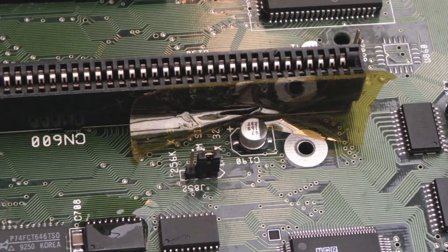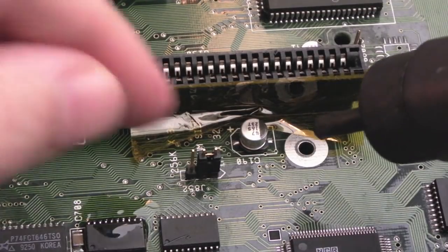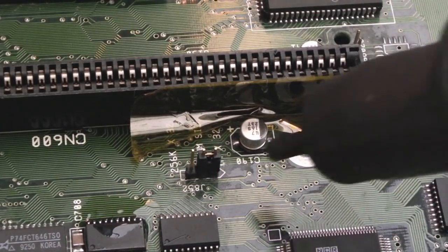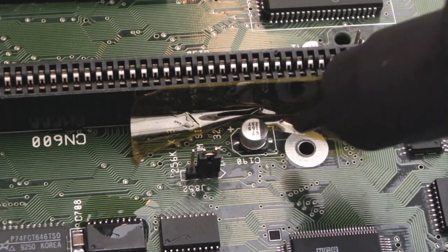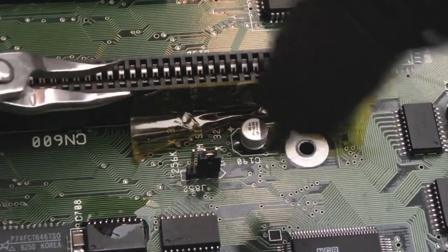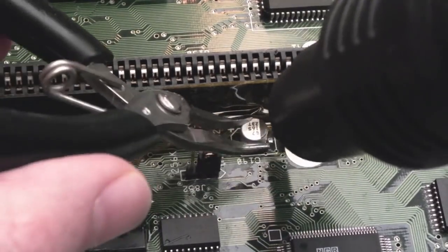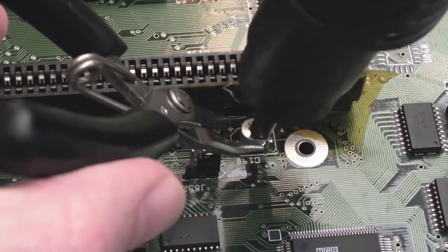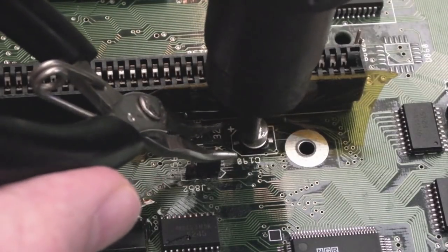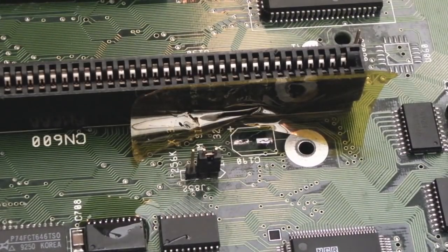I'm not sure that side there on that chip was soldered on properly on all the pins, because some of them look bone dry actually, and then after adding a little bit of solder and flux, it flowed really well, and you can see now there's definitely solder there. So anyway, I've got a piece of Kapton tape over there again. It's really restricted, this area. I'm struggling to get near the thing, there we go. That's that one out of the way.